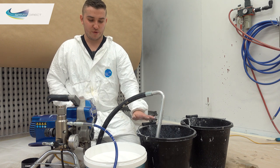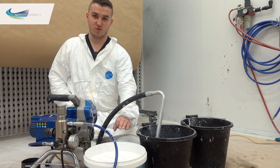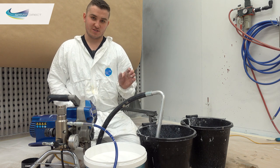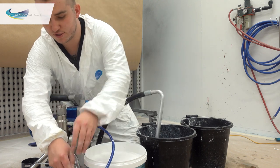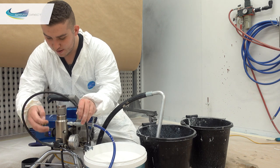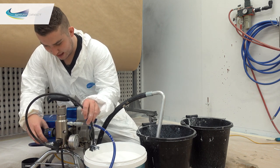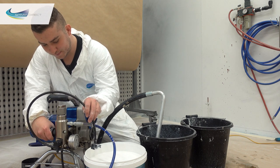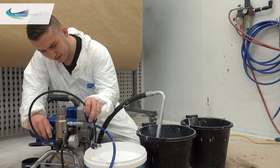When we're doing this it's important we use clean water, so that anything that does go back in here is just watering the paint down ever so slightly rather than contaminating it. So now we empty the prime tube — this is emptying the pump itself. Switch it over and just turn the pressure up slightly and there we go.